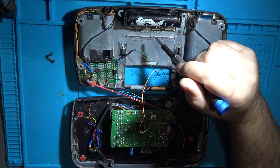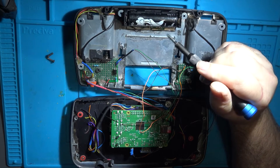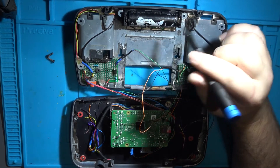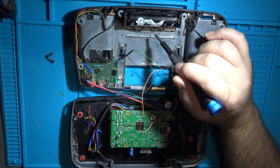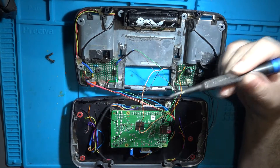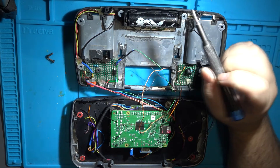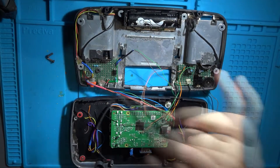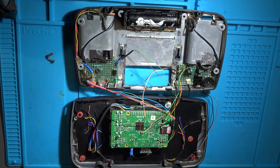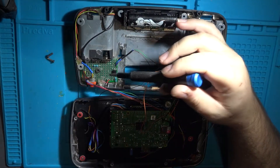The board has a particular chip with two LEDs — one indicating charging and one indicating fully charged. They're surface mount, which was a bit of an irritation. So I looked up the chip and found two pins that get grounded when either of those two states is met — fully charged or charging. I've run those off to an RGB LED at the front, so when you plug it in you can see whether it's charging or fully charged.